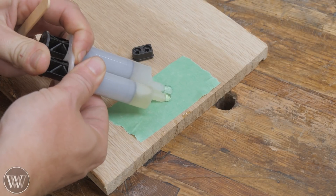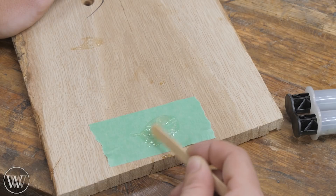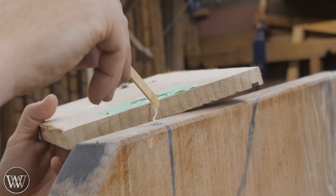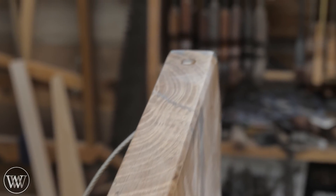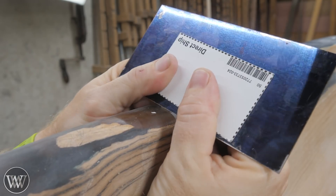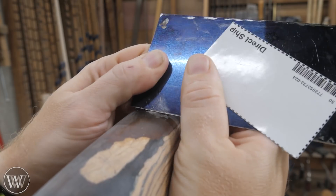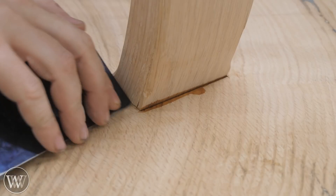The reason I'm doing that is I'm going to epoxy in the ends. Here is another mistake — I tried using five-minute epoxy so it wouldn't pour past the pins, but the color just didn't match; it ended up being a little more milky. I wish I would have put in some CA glue to stop it from going in and then used the same epoxy I used before rather than a five-minute epoxy. In the end it's just a little bit of coloring in there, but it's not too bad. We can do some detail scraping to get these down to flush, and there we go — we are ready for the final detail of all the epoxy.